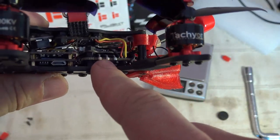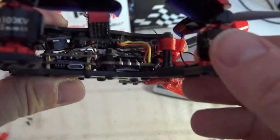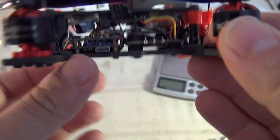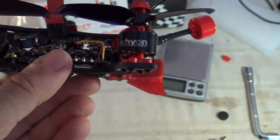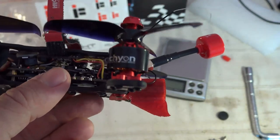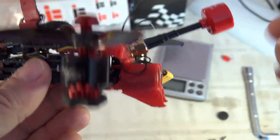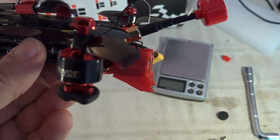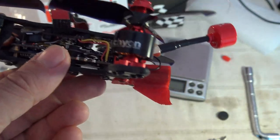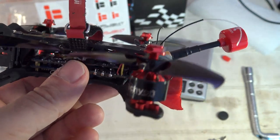Now on the back side, we have two electronic boards. The lower one is the 25 ampere ESC, and the upper one is the video transmitter. This is up to 200 milliwatts, from 0 milliwatts in pit mode, 25, 100 and so on, and linked with the rear side antenna via a micro FL antenna connected to the VTX board. This one is supporting the SmartAudio IRC Tramp protocol.